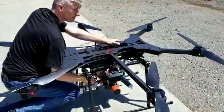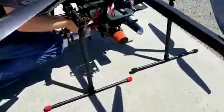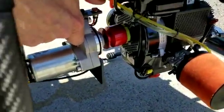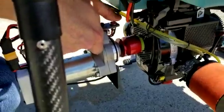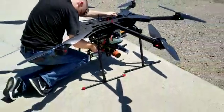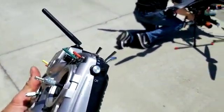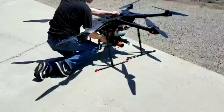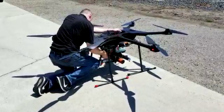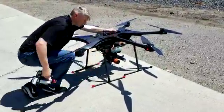At this point we're ready to start the aircraft. Roger's holding the starter on the back — it's engaged right there on the back of that starter nub — and you'll push the red button to make it turn. You need to make sure it's turning clockwise when you're looking at it from the rear. We'll set that to the idle position and Roger will go ahead and start it. After a couple seconds, you'll hear it start to fire, and then you can take the starter away.